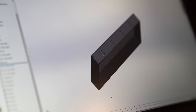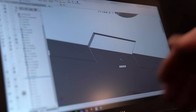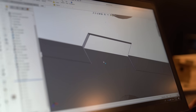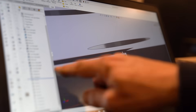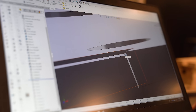So this is where we lock the two pieces together — they call that tab and slot construction. That's what we do a lot of times for fixtures. That serves as an alignment point and it also allows us to drop a little weld in there to join those two together. You'll notice we've got just a small recess in this part so that we can go in and run a weld in there and it won't be above the table.